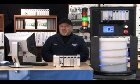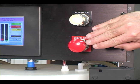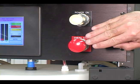As a safety starting point, make sure all personnel are clear of the process area and if possible have the process operating in manual mode and manually adjust the process output value to produce as much of a steady state as possible. During the loop tuning procedure, always be near the emergency stop push button or switch that controls power to the loop actuator in case a shutdown is necessary.